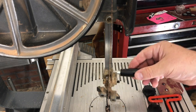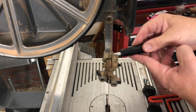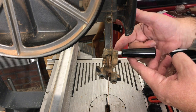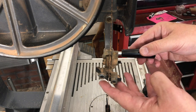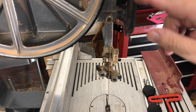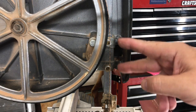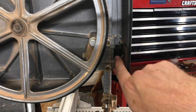This rod on the handle is bent at a 90-degree angle and goes all the way up inside here. It's not perfectly round — it has a flat side on it. Right now the flat is facing the back. When that flat faces the back, the post is loose. When you rotate it, it makes the post a little bit wider and locks it in place. What is it locking against? It's touching those two bolts — not the faces or sides, but the back side.